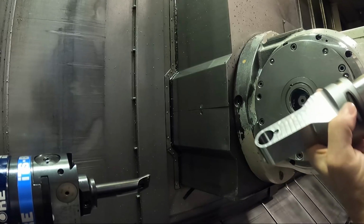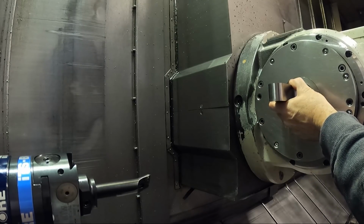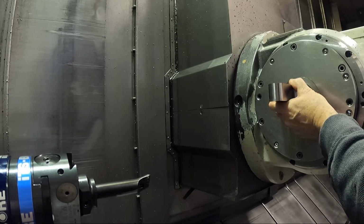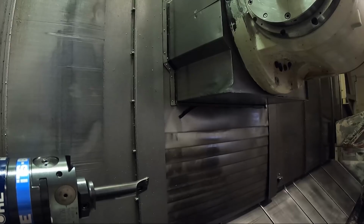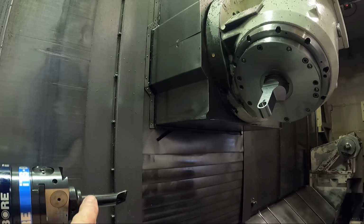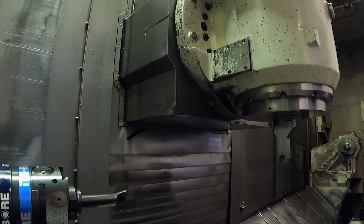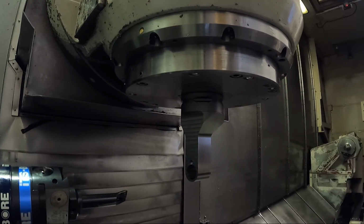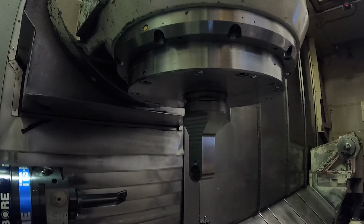And so we're going to put this, the spindle should be oriented in the right direction if I set the tool up correctly, like that. It's interesting. Sounded a little bit funny there. Okay. And then I'm just gonna manually touch things off here to our actual boring tool. We've only got kind of a rough setting here of where the tool should be. So if I've done things correctly here, I should be able to jog this over to Y0 now that I already set it. It should be right there.